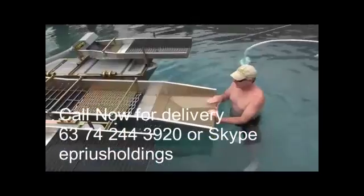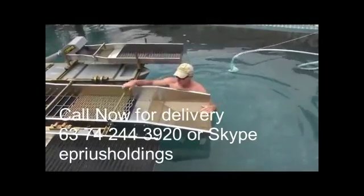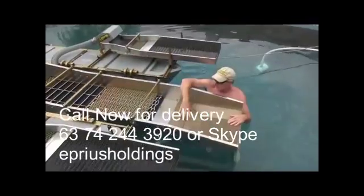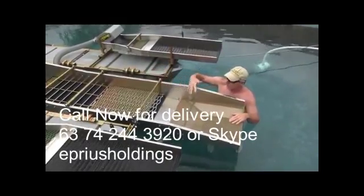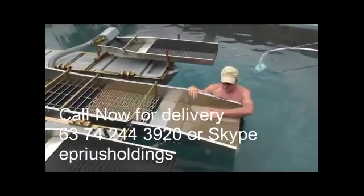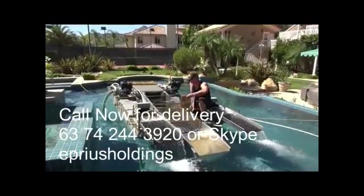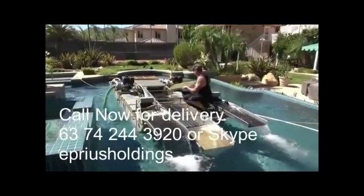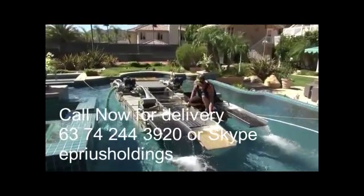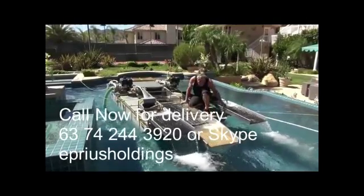So now to do a cleanup, starting right here, I'm going to take this riffle board and remove it, flip it upside down, and wash. I've now got all my riffles removed, and I have just one engine running, and all the material is washing over here. I might even have to rake some of the rocks out. And if you do have any big gold, you want to check along this line here, because you could have, hopefully, some gold nuggets piled up on the screen, but you don't have enough water velocity and force to wash the gold over the edge.